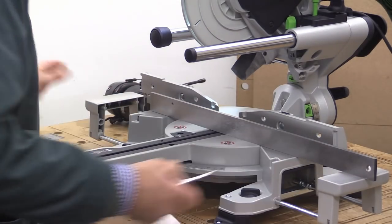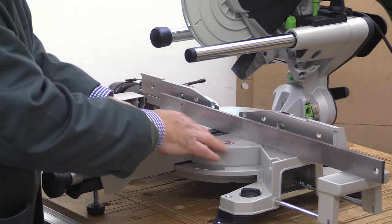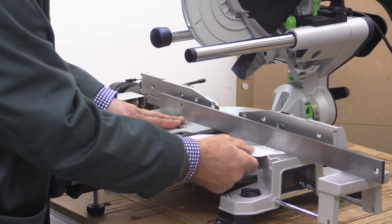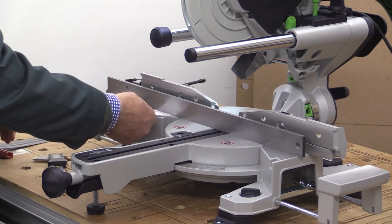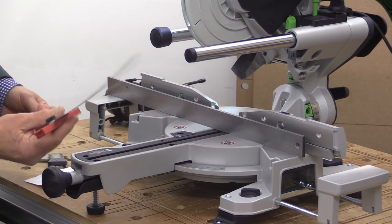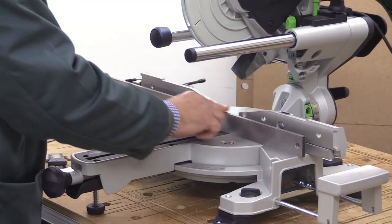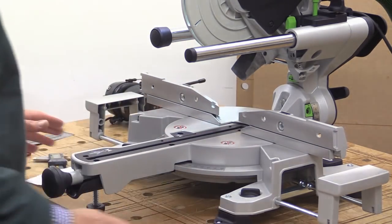People get worked up about the flatness across the bed, so I'm going to demonstrate how flat or not flat it is. It's flat across here with absolutely no problem. There is enough room to get a piece of paper under just. Moving to this side, there's a little bit of a gap — the paper goes through there, and this shim is a quarter of a millimetre thick. So there's a little bit of variation, but I don't think those measurements are enough to worry about.